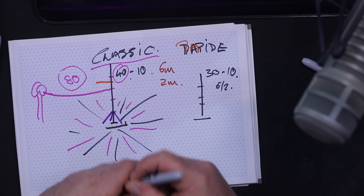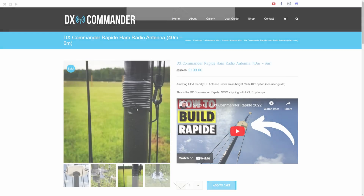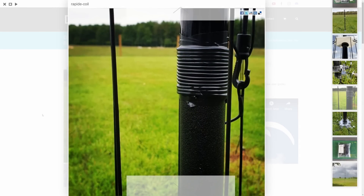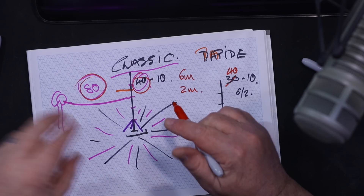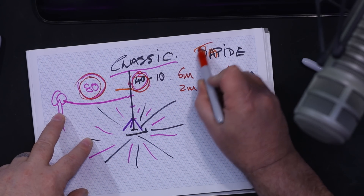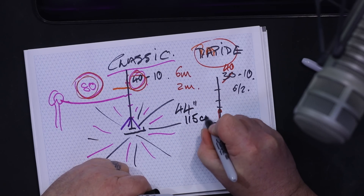Being inquisitive, I discovered that by putting a small coil — about 13 turns — roughly halfway up the first section, we can drop 30 meters and get onto 40. So it's a super compact antenna that does 40 to 10, but not 30. So fundamentally we've got the 80 meter version, the 40 meter classic, and the Rapid — that's the classic lineup.